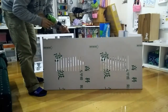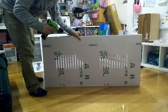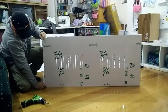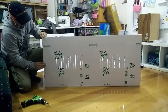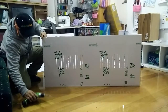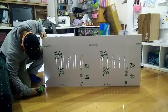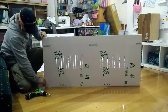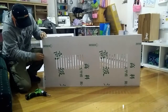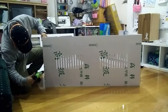So with the long screws, always use the long screws when it's a butt end joint. Now remember, don't over tighten. Over tightening would strip the screws. So flush, and in this case, let's work from the bottom. So that's the corner, everything's well locked in, the back, the sides, and the bottom's all locked in. There we go. Just nice. And if you want to make things easier, just grab the screws, give it a twist or so into these holes, so you can go bang, bang, bang, get them all in one hit.